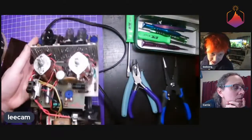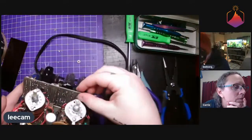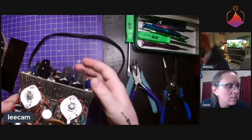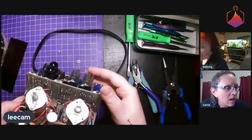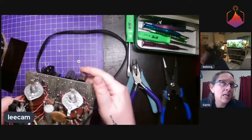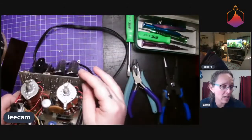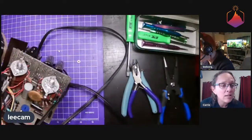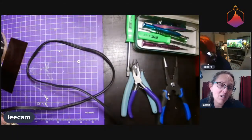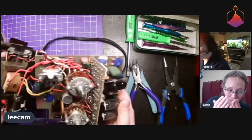I'm trying to show you guys. Yeah, I can see this array of pins at the bottom here. Oh, interesting. So they're not in a circular pattern; they're more in a grid. Yeah, totally. They're definitely in a grid. I would wonder, is there anything obvious that you can see there? I would look for super obvious things like parts of the board that are burnt or scraped, like if a trace is cut, things like that first. And always, if it smells like burnt electronics, use your nose to sniff around the board.